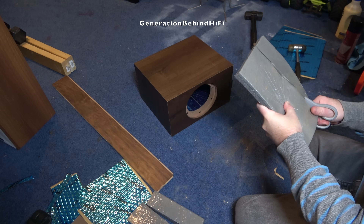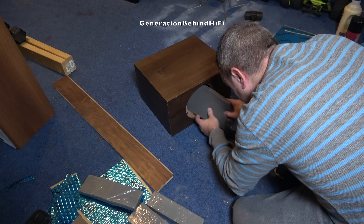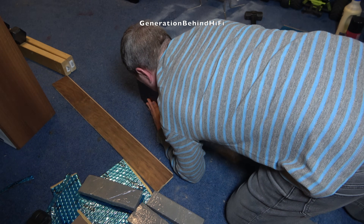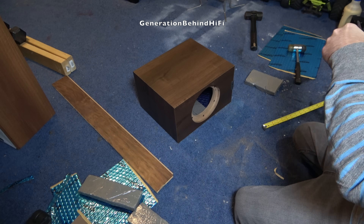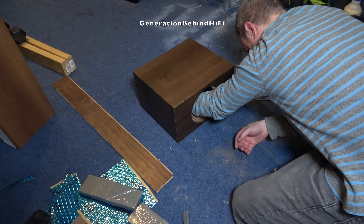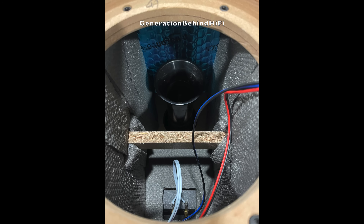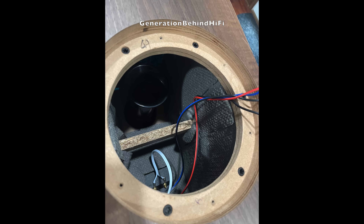Here I'm cutting the Sonic Barrier to fit inside the cabinet. This is a three-quarter inch foam material that includes a peel-and-stick back to make installation easier. Once I have the pieces cut to size, it's just a matter of peeling off the backing and positioning the pieces into place. Here's the cabinet after getting the three-quarter inch foam installed — I applied it to the two side cabinet walls and halfway up the rear cabinet wall. I had originally installed foam on the base of the cabinet around the crossover, but was getting a standing wave during testing — I'll talk more about this later.